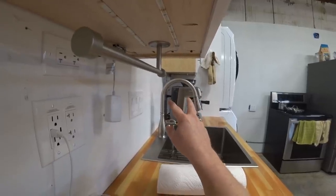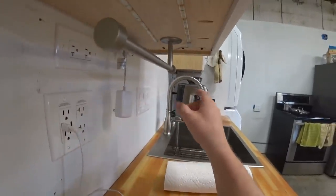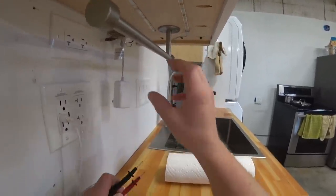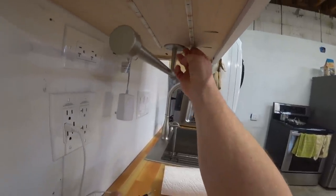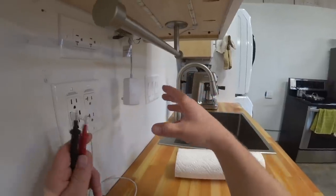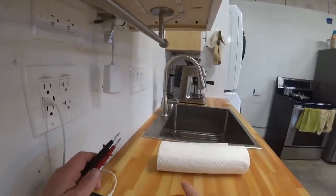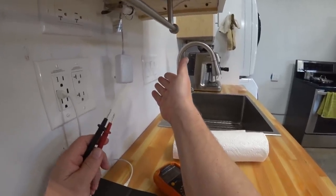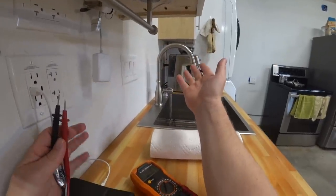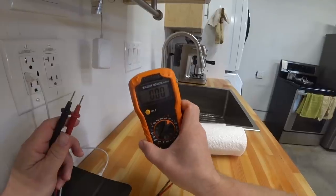Really quick, the reason that's happening is when we have two of these lights plugged in, this one and that one, the effect of this situation I'm gonna show you is kind of diminished because there's two sets of lights that are sharing this voltage, and so it's less. If I unplug one, the other one goes super nuts. So let's take a look at what's happening. So this light switch is turned off. So these lights are actually not on. So why in the heck is there voltage, right? Not good. So we're showing 0 volts.